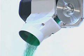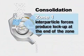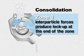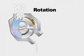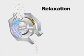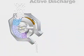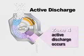The action occurs in four stages. Consolidation: in Zone 1, interparticle forces produce lock-up at the end of the zone. Rotation: in Zone 2, material is in lock-up condition throughout the zone and rotates as a solid body. Relaxation: in Zone 3, interparticle forces fall below lock-up threshold. Active Discharge: in Zone 4, active discharge occurs.